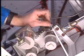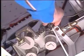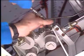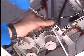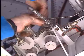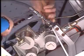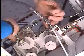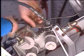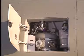Remove the cap from the ground connector. Connect the pressurising tool to the ground connector. Now turn the nut to open the ground connector.